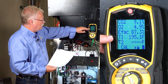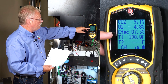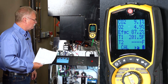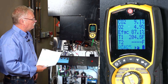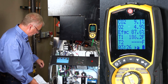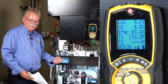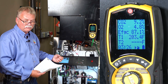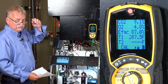As you can see, the temperature is going up because we're still moving the same amount of water, so we can't take as much heat out. So the flue temperature goes up and our calculated efficiency is going down. We seem to be at about nine percent CO2 there. My gas on high fire has dropped to about 5.9 inches, which means it went from about seven to about six. That's well within the range of this manufacturer. This boiler can fire down to three inches of water column, but I have no way of controlling that because I'm limited to what the city gives me.